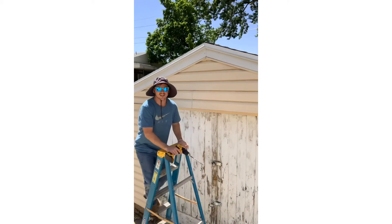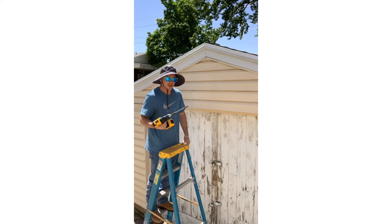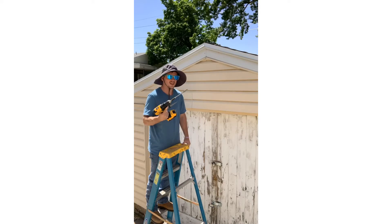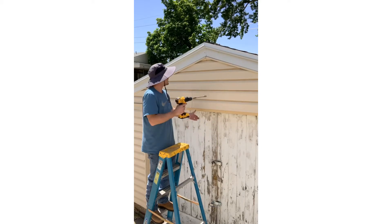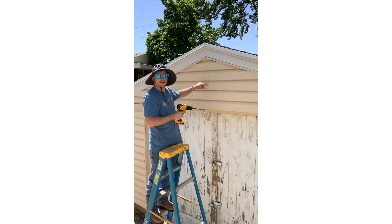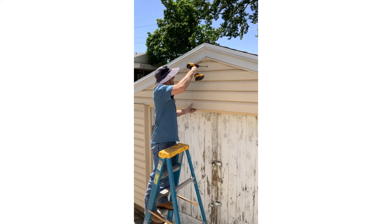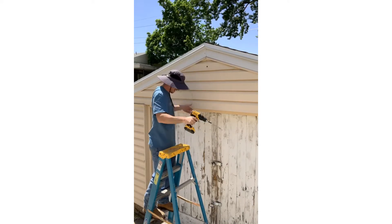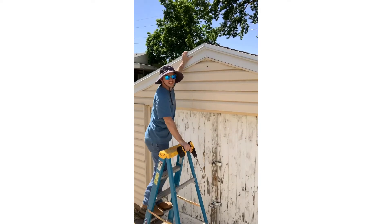Okay, let's get started drilling our hole. We're going to start with a 5/8 wood bit — hole saw bit thingy. Hopefully we don't hit brick; if we do, we'll pull out the masonry bit. We're going right in the middle right here. And it looks like we're hitting wood, so that's a good sign.